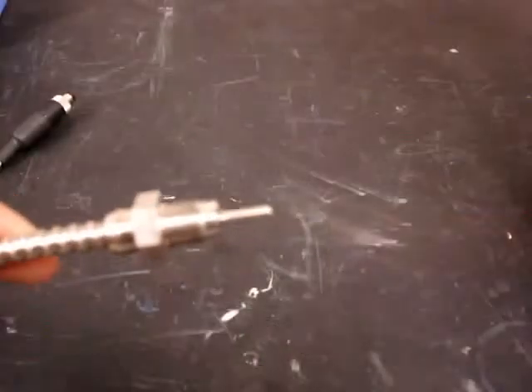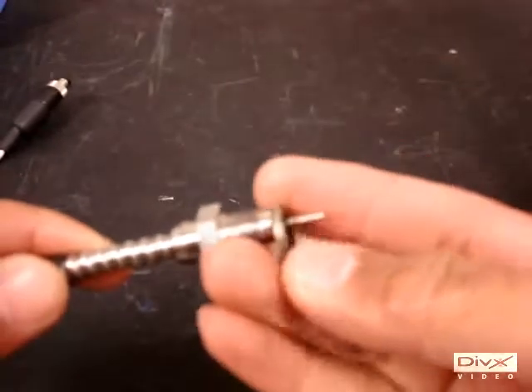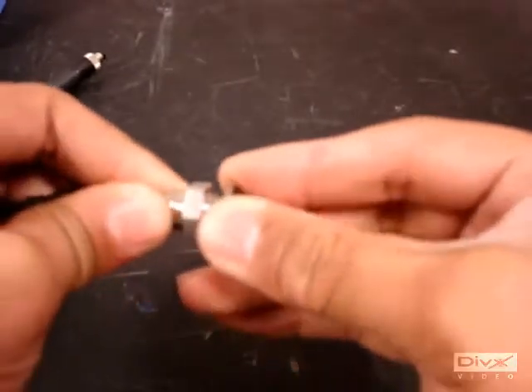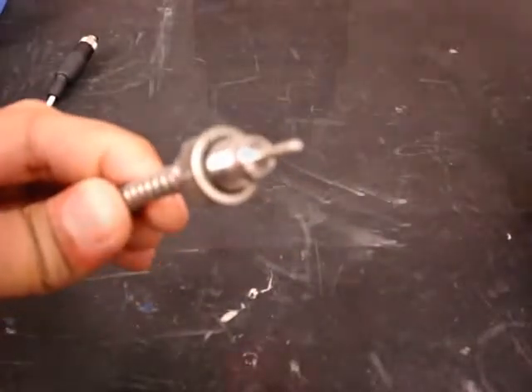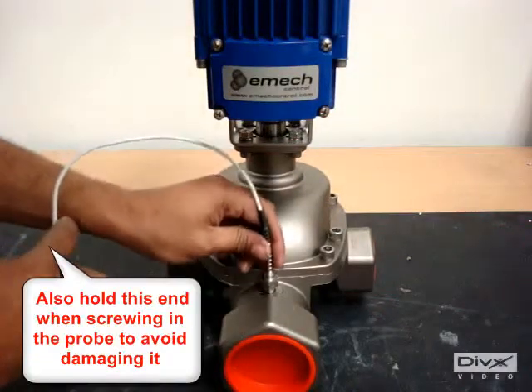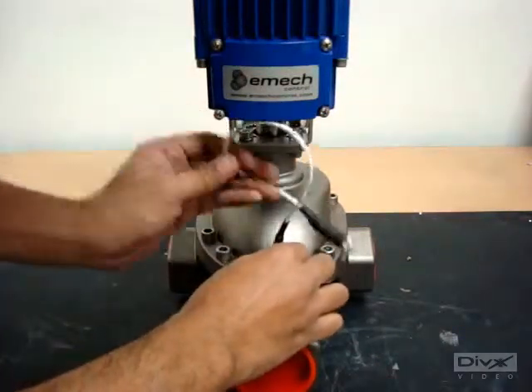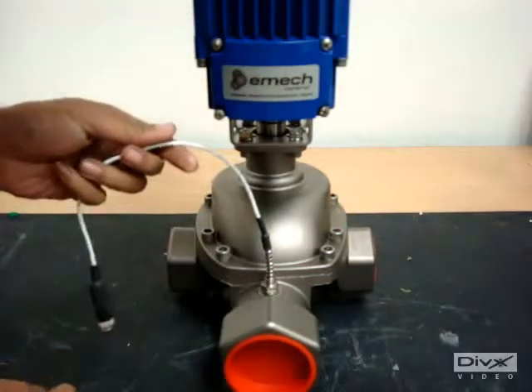This is how the actuator is mounted on the valve. Before installing the temperature sensor, attach the bonded washer into the probe end of the sensor. Screw the temperature sensor into the outlet port, holding both ends of the temperature sensor so that it won't be damaged.